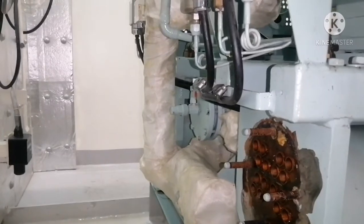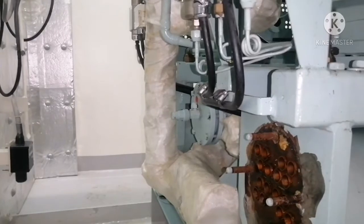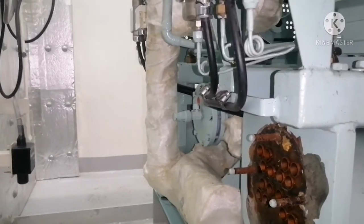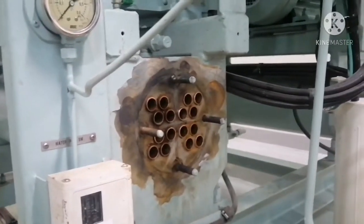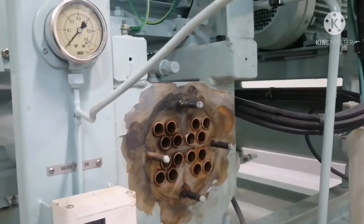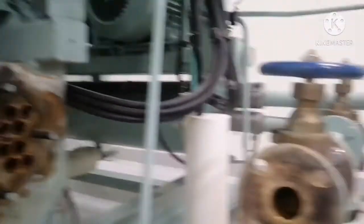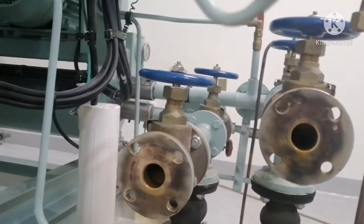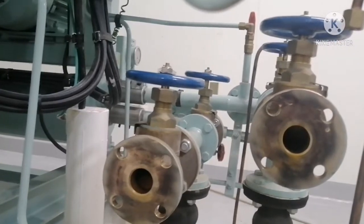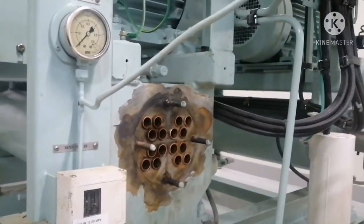While cleaning, you have to ensure you are using the right size of brush. If you use a hard or oversized brush, it may get stuck in between the tubes, and that will create a problem when removing the brush. We have now cleaned the cooler completely. The cooler gasket area is completely clean, all connections and flanges are buffed and clean. There are no old gaskets and nowhere is dirty.